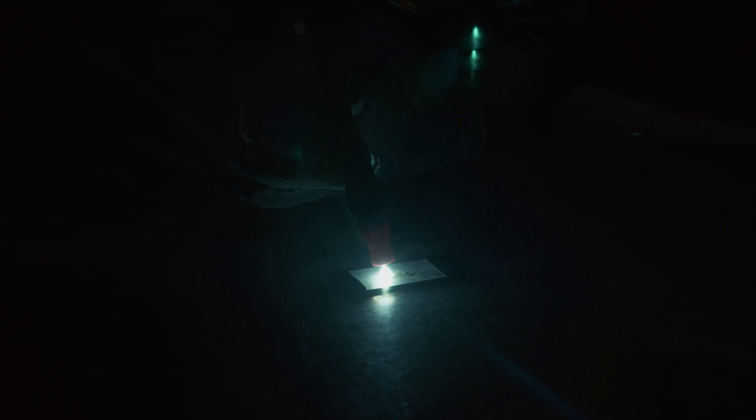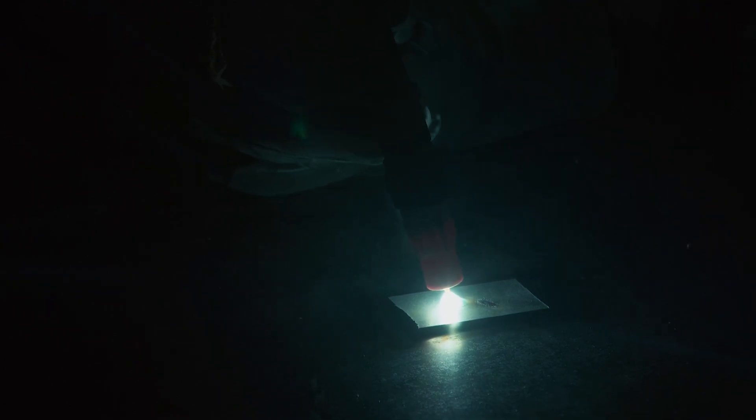How easily does the arc start? A good arc ignition will look slightly different depending on how you're creating it, but it should generally look like a flare of light with a soft puff noise. A good arc will come out in a cone shape. If all your machine settings are correct and your tungsten still starts with little light and remains dull or weak looking, it doesn't have a good arc ignition.